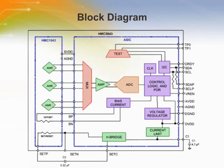Here is a block diagram of the HMC 5843. The magnetoresistive sensor circuit is a trio of sensors and application-specific support circuits to measure magnetic fields. With power supplies applied, the sensor converts any incidental magnetic field in the sensitive axis directions to a differential voltage output. These signals are multiplexed into the amplifier and sent to the ADC. The control logic block switches the system clock, I2C bus interface and measurement modes. The H-bridge contains large switching FETs capable of delivering a large but brief pulse to the set or reset strap of the sensor. The bias current generator is used to apply a bias current to the offset strap of the magnetoresistive sensor, which creates an artificial magnetic field bias on the sensor.